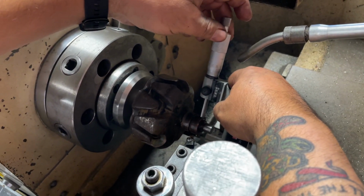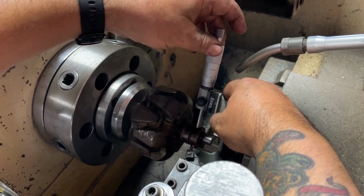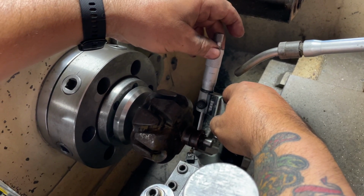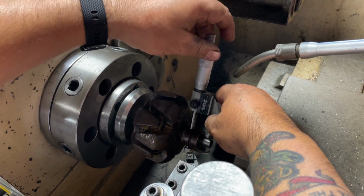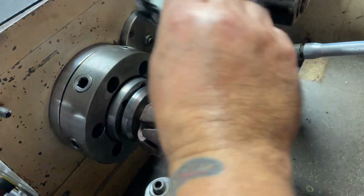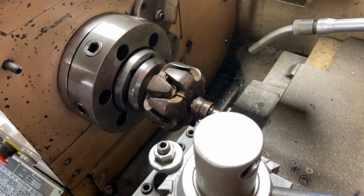And this one right here is 4634. That's only two hundredths. You want to go to the smallest diameter we got and then machine everything down to that. And then maybe a mil lower than that. Okay, then we got the right one. I will put the math in the description below the video.